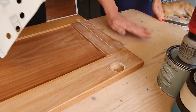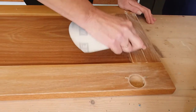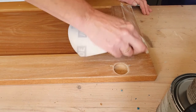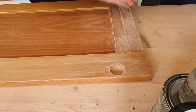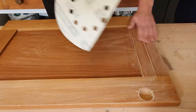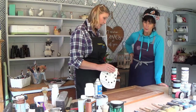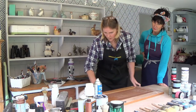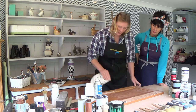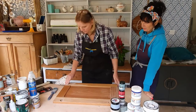Although there are some paints that say you don't need any prep, and actually probably to get a great finish and a hard finish you don't actually need to prep to get a good-looking finish, but to get a lasting finish that isn't going to change, I think it's very important. Because with the best will in the world, if you've got a very shiny piece, no matter how hard the paint sets, if it gets knocked, it's just going to chip off.